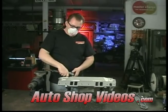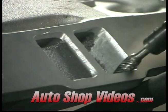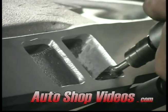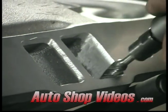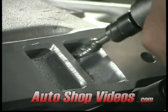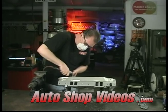Before I forget — keep the bit moving, don't hold it in one spot. Even when you're trying to shape a corner area, don't just hold it there and grind in the corner, because it's hard to get that divot back out. Always keep it moving. If you're in a corner, keep rolling it back and forth — that'll get the shape you're looking for. You can do a little back and forth, up and down, but if you hold it in one spot you're just going to burn a hole that's hard to get out of.